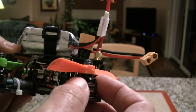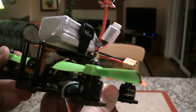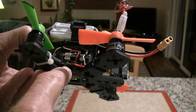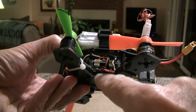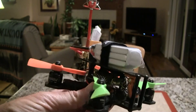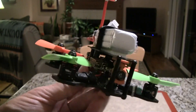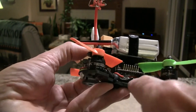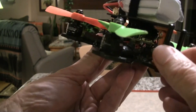I have two other quads with the same motors, that's why I kept this size. If you're just starting out, you might want to go with the 5000 KV motors — those would work great for this size, a little faster. One of the other small items that makes these 130-size builds possible is the reduced size of your radio receivers. It's about the size of a thumbnail. I stuck it underneath the power distribution board; it has a little copper antenna wire that comes up. They work for probably up to about 200 yards or 200 meters maximum range — so for a little park flyer or backyard flyer, they work great and only weigh a few grams. The power distribution board comes with it, and I put a Naze board with pins for the ESCs to connect to it.